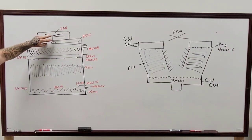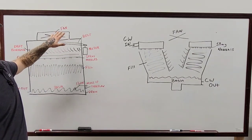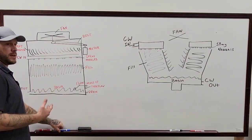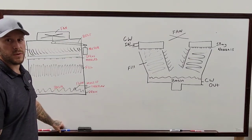There's a mechanical type beam that runs across both sides of this. A lot of times on either side that will crack. That's a super important thing that we need to actually look at. You need to verify that there are no cracks there, because once the tower is running again and you're not sitting in there, you won't see the damage that it's going to cause, because once that goes, it's done completely.